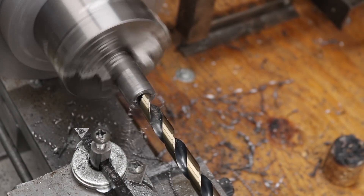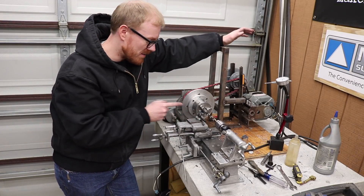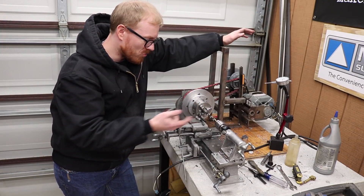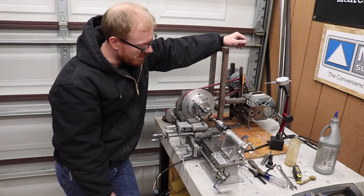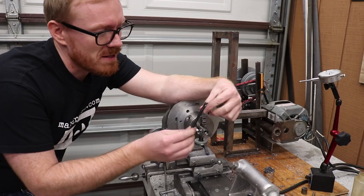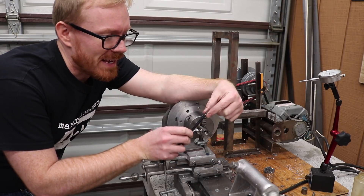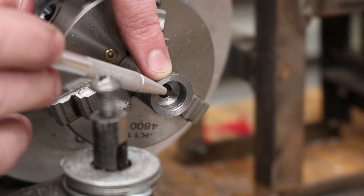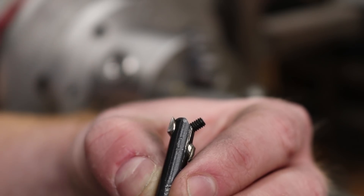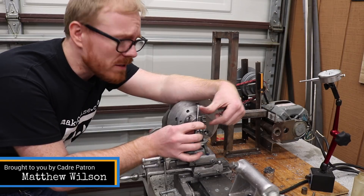It's just an interesting observation, but now I need to enlarge the recess because the stock that I need to make the center for is actually 16mm. So I've got to go a few millimeters larger than my largest drill bit, probably with a boring bar. The next problem is that this boring bar has a set screw that I really need to get right up against this inside corner, and I think I have to use the angled side versus the perpendicular side like I typically use.